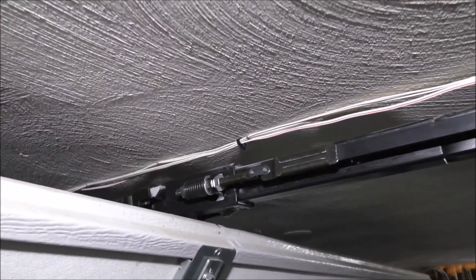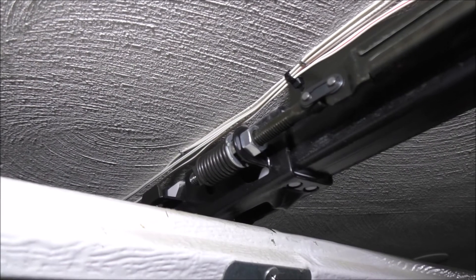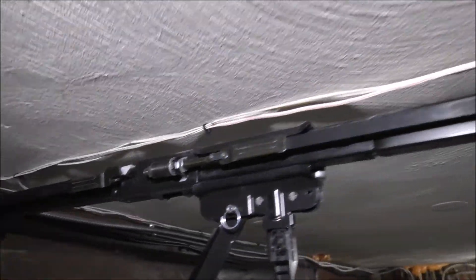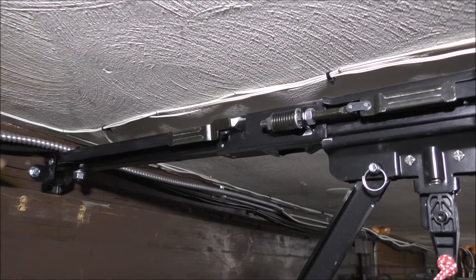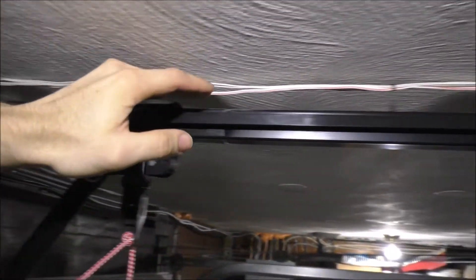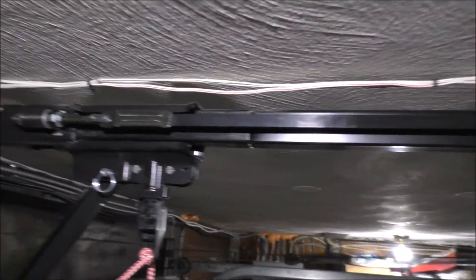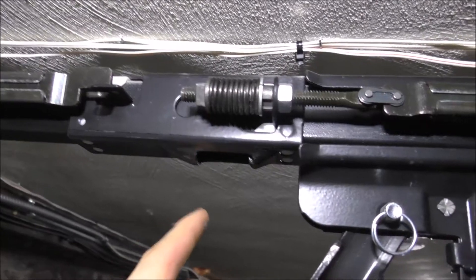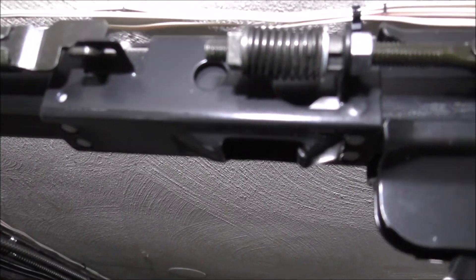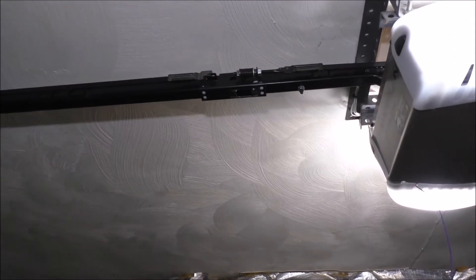It's very odd for these doors to do that. I think it's not just the opener itself — I think it's more because we have very low headroom, or the installer did not install these properly. I can't tell if they're level without measuring them and putting a level on the tracks. This is where it hits — you can see the white paint where the door comes up and stops.